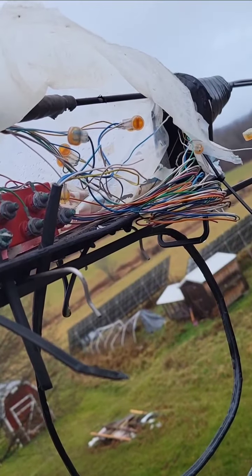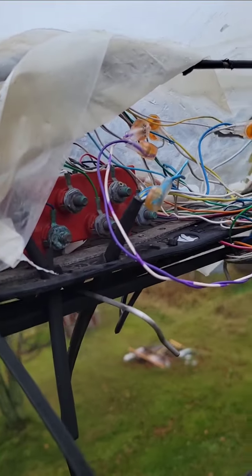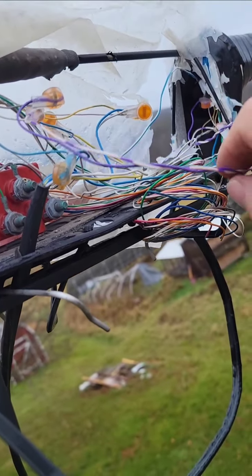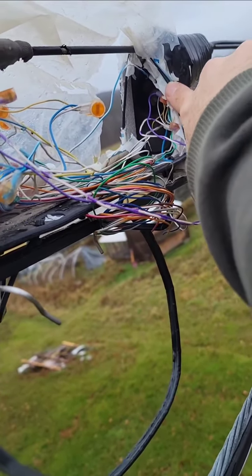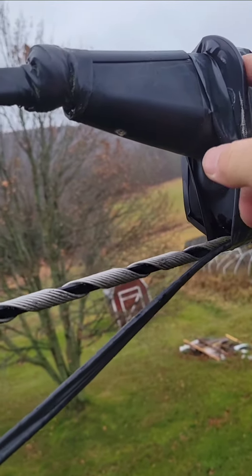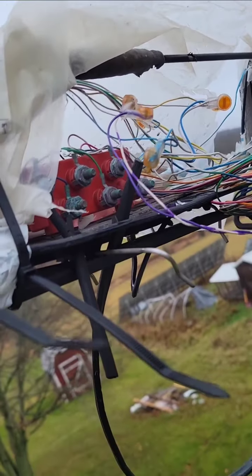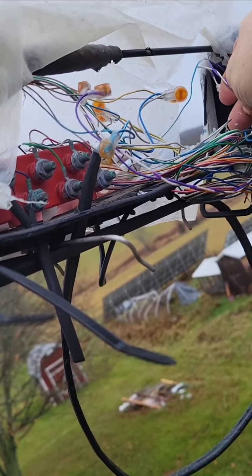We should have good dial tone on the other side — we should be able to put them back together and be good. This is what the fix looks like. We cut back on the pair until we've got good wire that has intact insulation. I had to add wire because I had to cut this one back all the way back there as well. Sometimes you won't have good enough wire, so you'll have to actually skin back the main cable until you hit clean wire, and then you'll splice onto that. But we got lucky here — we had a little bit of usable wire left to put a little extension in.